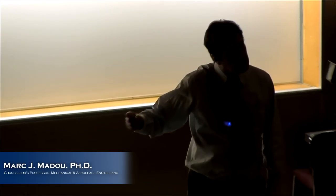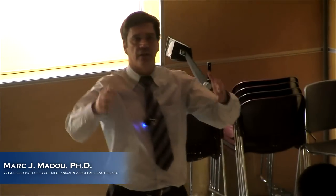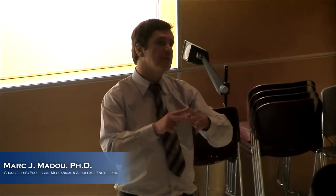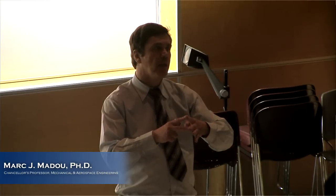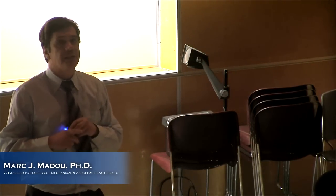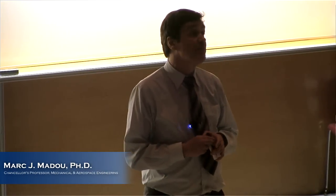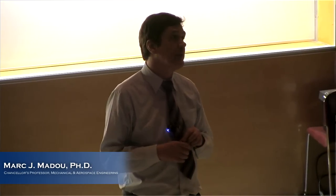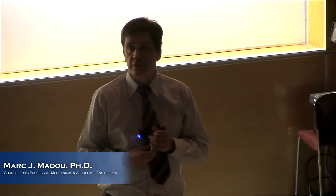What is that? You said there's radicals in there? Yeah, so suppose you have a soup in a vessel of radicals, ions, neutrals, and electrons. What about ions versus electrons? There'll be one more electron than there are ions. No, but remember, they're disappearing, right? The vessel walls. I'm introducing a very interesting additional concept about the plasma. They're being generated, but they're also disappearing. And the one that's the least stable will have the lowest concentration. So electrons will be the lowest concentration.